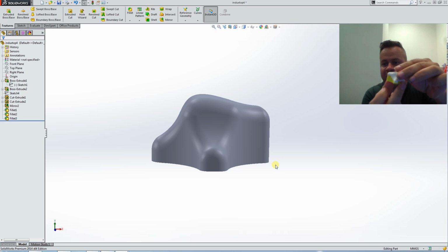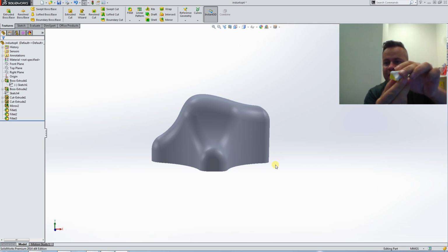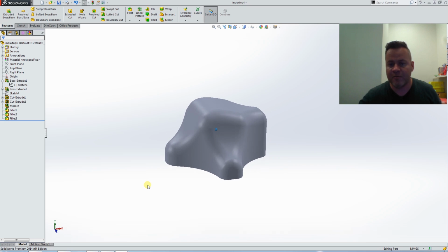You want to go ahead and design that in your mold, so keep a positive draft, so nothing that goes underneath it, as well as give yourself extra height because you're going to need a cut line. So when you design the part, don't design it to look like that, because remember, if you try to vacuum form that won't work. So you have to take everything that's overhanging and go straight down with it, and you're going to have to come back and trim that out afterwards, and so you're going to end up with that. So this is a real quick drawing that I made, and then from here I just took this right into my 3D printer and printed it off, and we'll jump over to that.